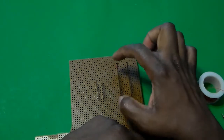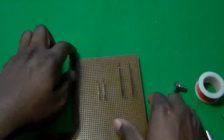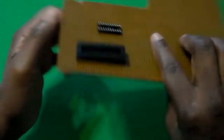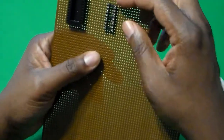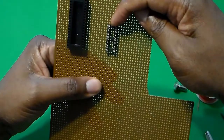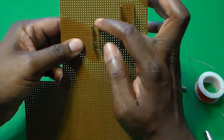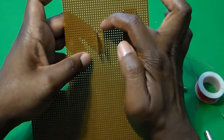From here, what you want to do is go through your schematic diagram and see which legs of the sockets are to be connected to other legs of the other socket. Now the interesting thing about this is because we're looking at this from the underside, things are going to be reversed from how they are on top. On top, my notch is here, so pin one is on the upper left. But when I flip it over, pin one is actually on my upper right.